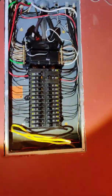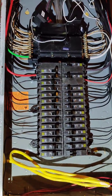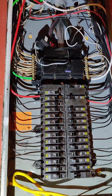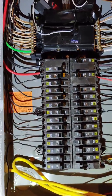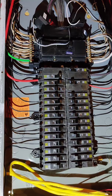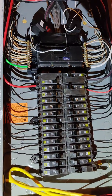Here we go — we're on the AC side of my power wall, coming out of the main panel. This is a work in progress, so bear with me, I'm still running tests. I'm coming out of the main panel with a 60-amp two-pole breaker, number sixes going over to feed the inverters — that's 120 volts on L1, 120 volts on L2, sharing the neutral in the inverters.